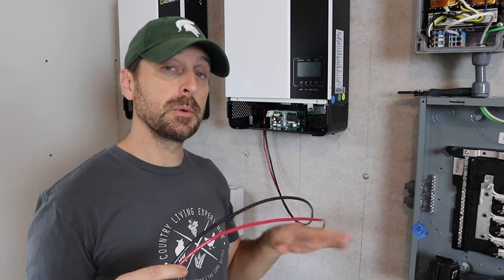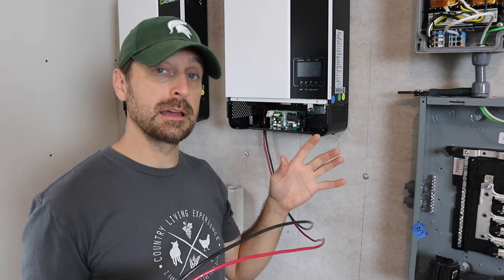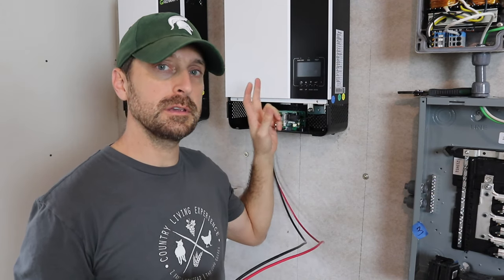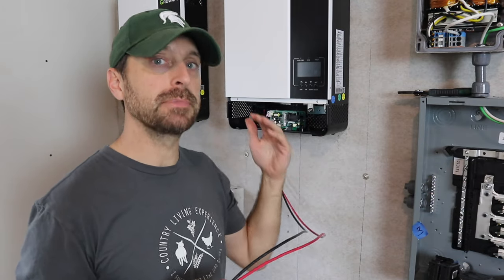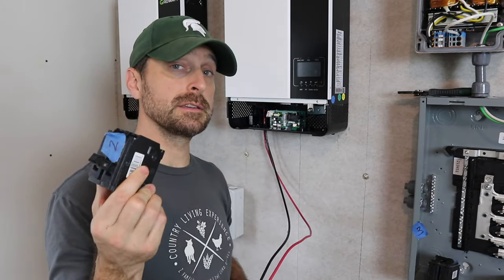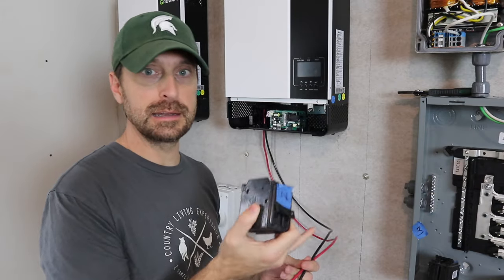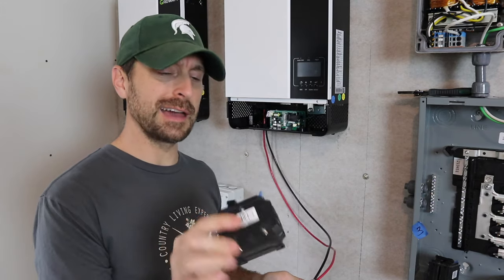So let's talk about the wire. Originally I was told that 10-gauge wire would be appropriate, but 10-gauge is actually good for the 3 kilowatt inverters. These are the 5 kilowatt models and the manual recommends 8-gauge wire. So I bumped that up to 8-gauge and I'm going to bump up to 40-amp breakers instead of the 30s I was originally directed to. You can run the 8-gauge into a 30-amp breaker but it will trip at 30 instead of 40, so you wouldn't get the full amperage if you needed it. So I will be swapping these out for 40s.